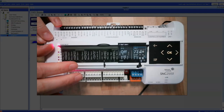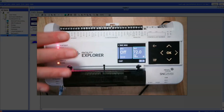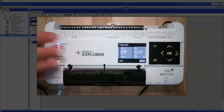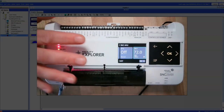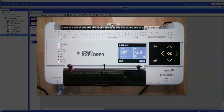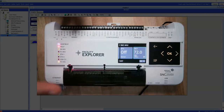So my biggest turnoff to this controller right here is going to be being unable to connect it to a supervisor, right? As a connection. Having to buy those device packs. Those device packs are expensive. They're a lot more expensive than just adding a connection. So the best thing to do would actually be to throw this under a Jace. Well, you're already paying the price of a network engine controller, so you're already paying for a Jace almost with some I/O to it. So your best option, in my opinion, would be to go with the F4 CGM or CGE controller, right? Either the MSTP or the IP controller, and then just put that under a Jace.